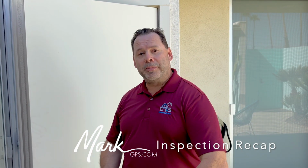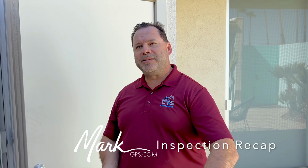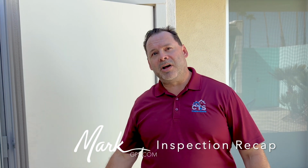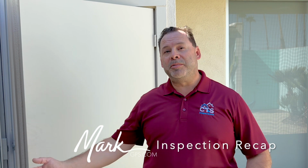I don't see any evidence of a roof leak or anything on the roof that shows it was patched or anything like that that could have been the source. So if it was a wet carpet, then the chances are, without seeing it firsthand, it probably came in through the base of the slider door, which you can probably see. I saw a little bit of rust or discoloration on the slider door in that room, so that could have been the source.